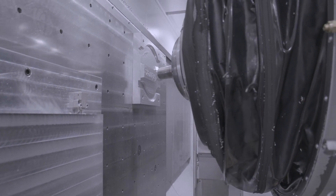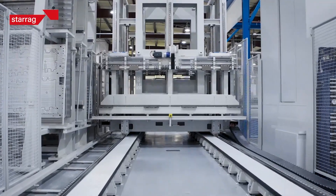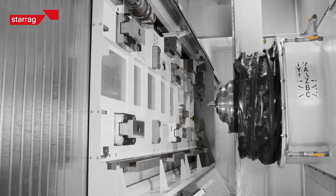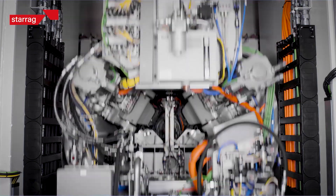Does this achieve the same dynamicness as other constructions or is it better, and if so, why? It's a better construction and that's why we actually developed it. The problem with rotary heads and rotary axes is that they can't accelerate as fast as linear axes. In front of this head there will be a vertical pallet holding maybe a six metre by two metre billet of aluminium. That whole assembly weighs about 20 tons, but we're going to be accelerating that at around 1G. A rotary axis can't keep up with that, particularly through fairly complex shapes.